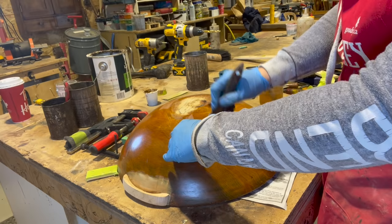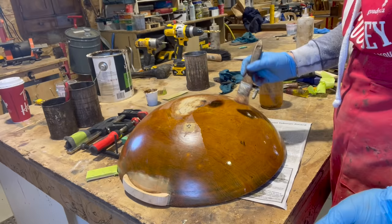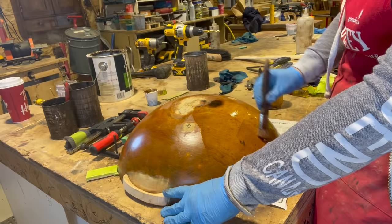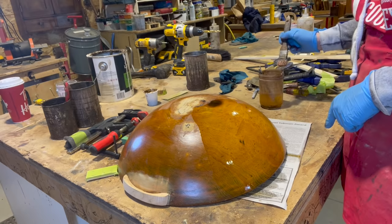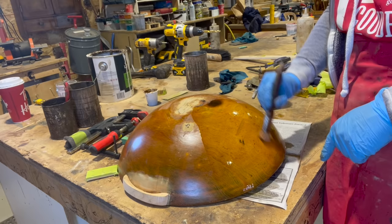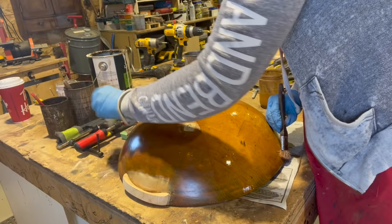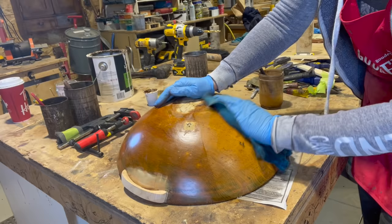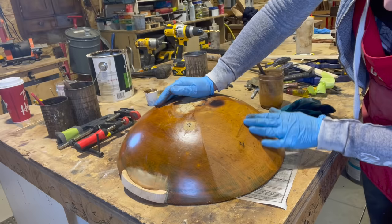the shellac finish. And you can tell, you know, it starts getting a little bit sticky. I can feel a little bit more resistance with my brush as the finish is getting softened up. And there won't be a lot of it on here. But you can even tell the color difference as I go across and remove that shellac layer there. Beautiful, nice and clean and ready for a sand. Might try to steam this up a little bit, but other than that, that's how I'm going to clean this whole thing up.